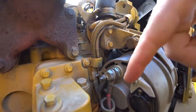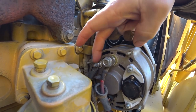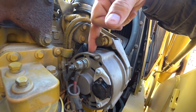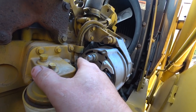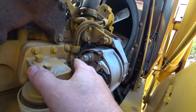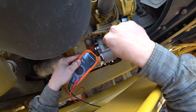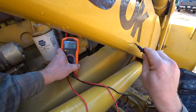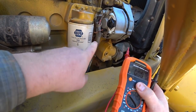According to the manual, the wire that we're trying to chase down the connection on is this wire. When we jumper across to the battery terminal it kicks the alternator on and we suddenly get voltage. We should have 12 volts at this wire, though I'm not certain we have that. I think that just goes to the gauge — the tachometer and the voltage indicator light.